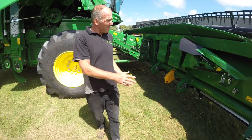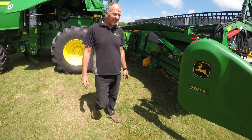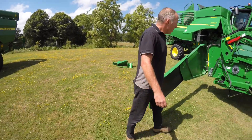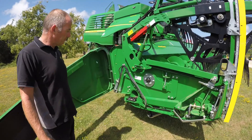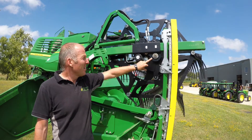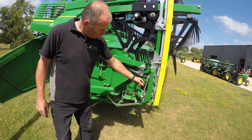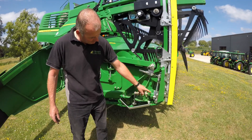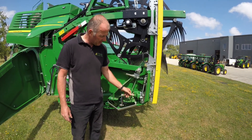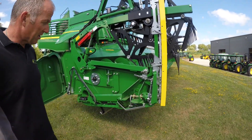On the header — there are a fair few moving parts on the header, but there's not that much to do daily. They recommend nothing needs doing daily; it's only 50 hours. But there are a couple we wouldn't skip — we give these a pump every day. With oilseed rape, just keep an eye on these bolts for the first day or so and make sure everything stays as tight as it is, otherwise it will start to come loose and shake itself to pieces.